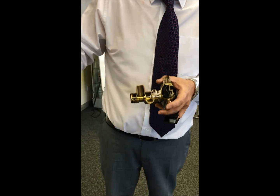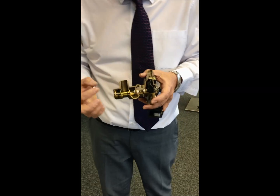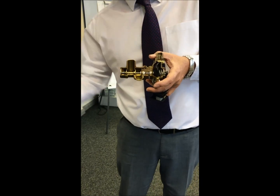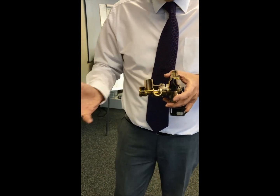And basically all it is, is some debris stuck in there. I've seen it on brand new boilers many years ago where there was a blob of solder just stuck in that disc there, so it was allowing 50% of the water to go to the plate and the other 50% to beetle off around the heating. You know, so as I say, it's simple.